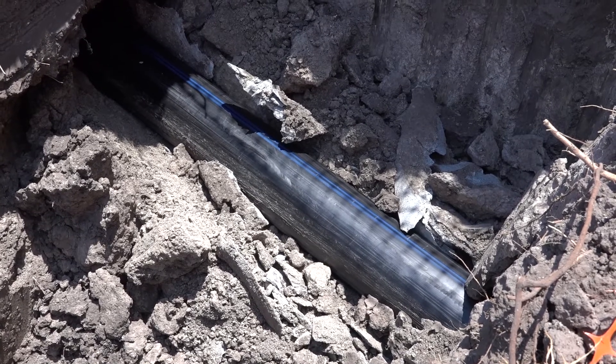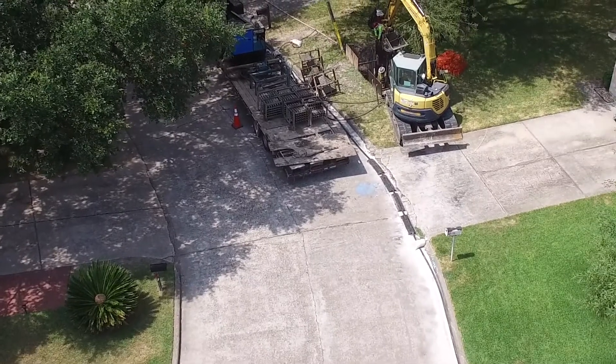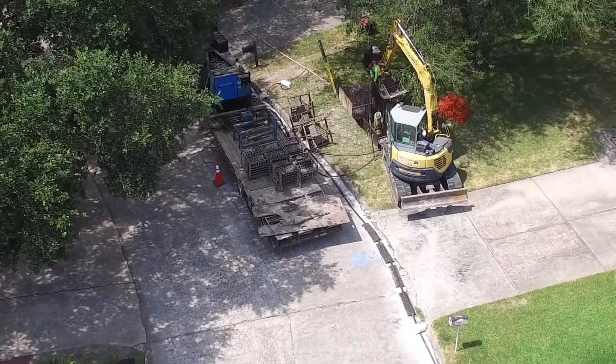We utilize HDPE because it's a durable material and it's joint-free, and we're able to pull it down the road to our pits. One of our largest complaints is dust when it comes to construction — we hear that complaint over and over again. Since the excavation is so minimal with pipe bursting, we really haven't received any complaints about it. With our residential survey, the number one complaint was construction time, so we're addressing the number one issue that our residents complain about.